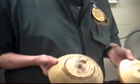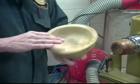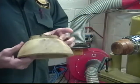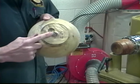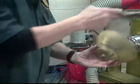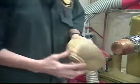So anyways, what I like to do is have something that I can hold on to. And there's 2 different ways to do it. This particular one, I used a large set of jaws. I knew that the grain was pretty wild on it, and so I left it thick, a little less than an inch. This one's been drying since October. What I'll end up doing with this, because I still have the point on here from the tailstock, is I'll take the tailstock and put it on here, like that, and then I'll turn this chuck again, retrue it, and I'll just use a smaller set of jaws on this piece of wood.